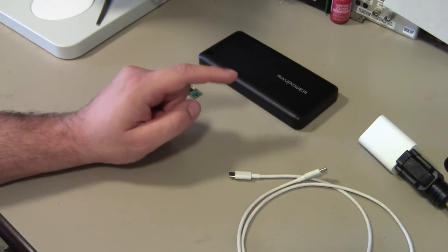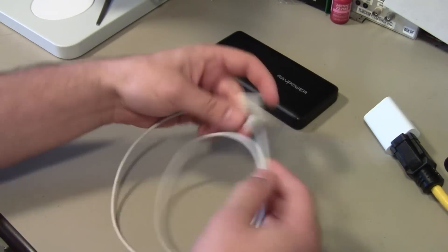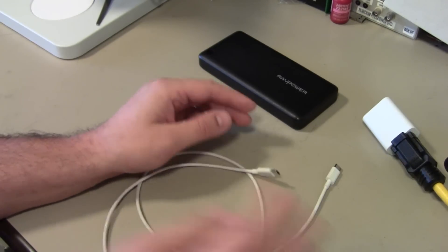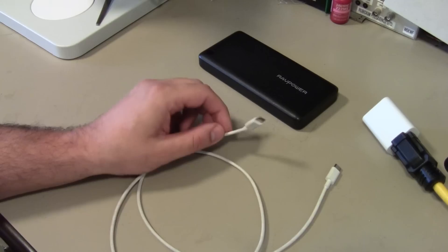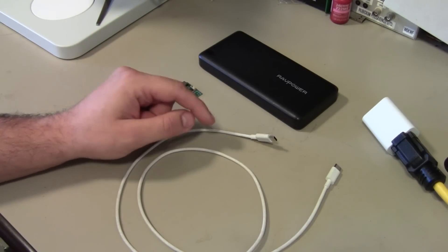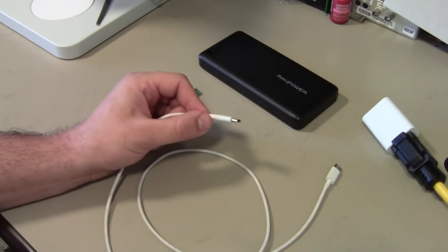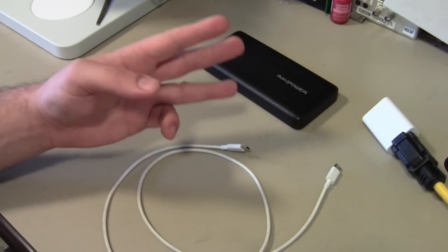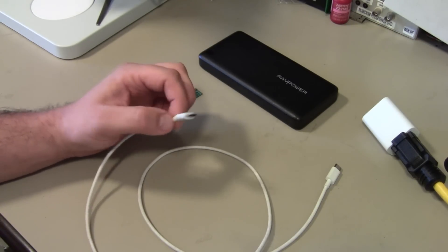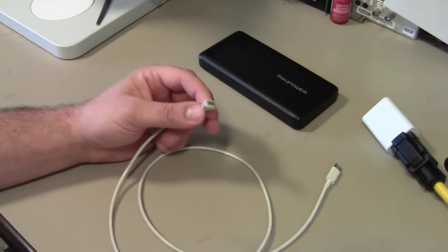USB-C power delivery is pretty neat because it means that every USB connector is the same — USB-C. Which means that your cables in the mythical world where this actually worked out well are all just symmetric end to end. There's a lot of realities and details where USB-C didn't work out to be as simple as we hoped, but the main thing I want to talk about is power delivery, where instead of being limited to only 5 volts, USB-C actually lets you negotiate either 5, 9, 12, 15, or 20 volts and up to 5 amps. And so USB-C made it possible to now charge laptops off of USB-C, which means that you can now have whole laptops that have nothing but USB-C connectors on them.